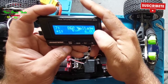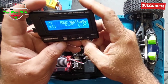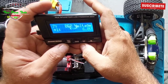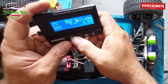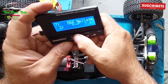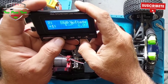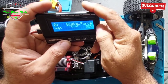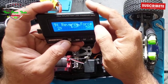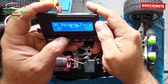The servo BEC I have at 6 volts — it is enough. The servo has a lot of speed. I do not need to go up to 7.4V, that is the other option. We can see and change the value here. The brake force I have at 50% — it is enough. And the reverse brake also at 50%, which is also enough because I really use it very few times.